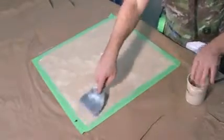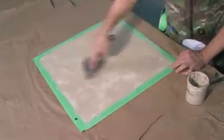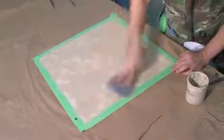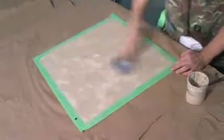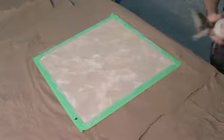The polishing is only to cause the plaster to add dimension through a tonal change, which only happens when the plaster is rubbed. This plaster has an earthy appearance and a matte finish. If you desire a high sheen, then coat the surface with Duragloss for protection and sheen. Greenstone is available in any color and may be applied in a single color or combination of colors.